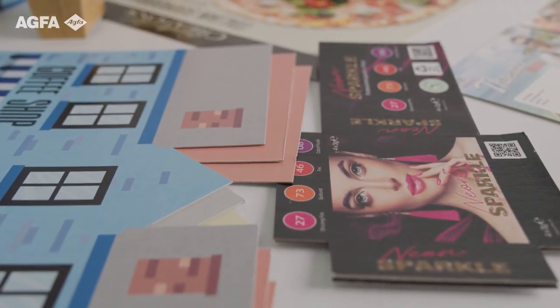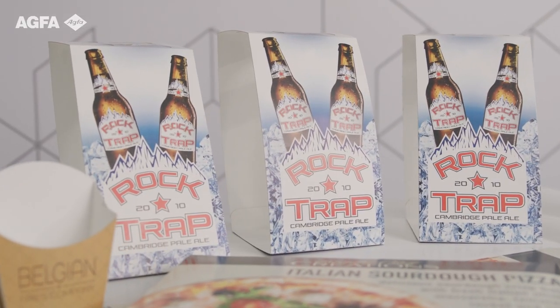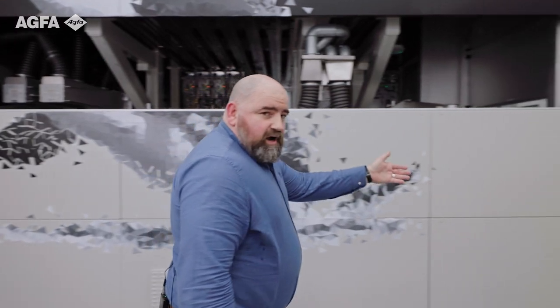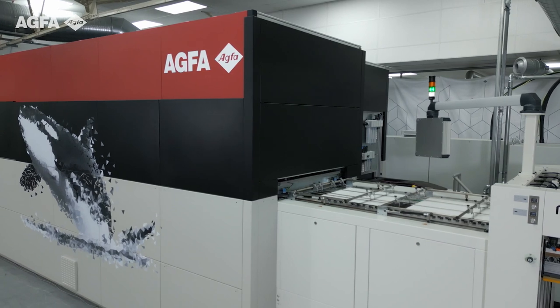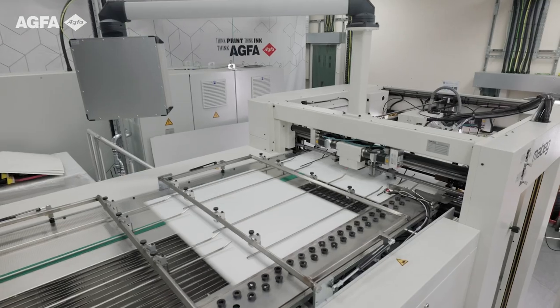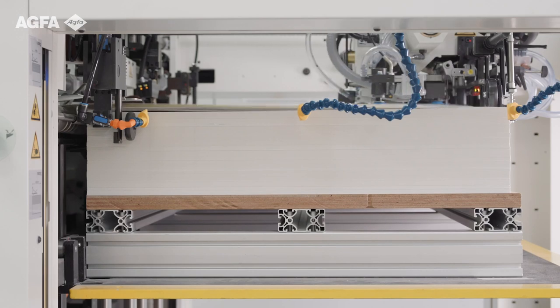Here we're focusing on folding carton, paper-based and microflute corrugated materials. Starting with the feeder, which for our device here is feeding from the right. This is a very early design change for us in order to satisfy the market adoption through switching the orientation from left-to-right to right-to-left.